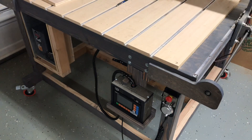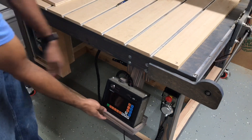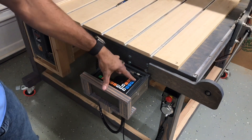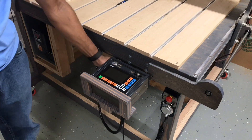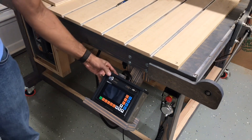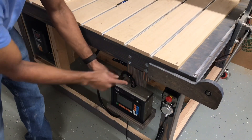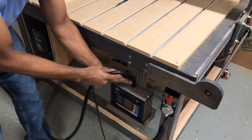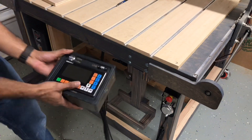I have the mount installed so let's take a look at it. It does articulate so I can change the angle of how I want to view it. With the handle I just go ahead and clamp it — it's got good enough clamping power for button presses and it's not going to lower even from vibration of the CNC while it's running. When I loosen the handle it does move nicely. I don't have to worry about it coming out of its cradle because I did install a latch so I don't have to worry about dropping it. If it's tugged on, I can undo the latch. Now I have my mobile offline controller.